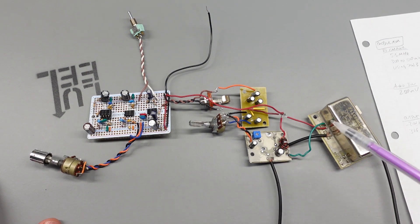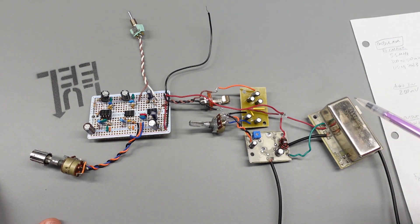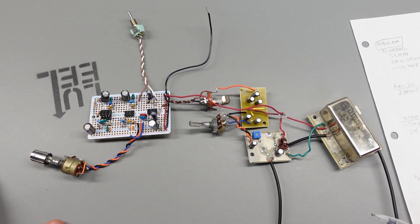A couple quick items before I move on. I want to touch on the trimmer caps — C5 and C7 are both missing. I was going to adjust those to maximize signal throughput through the filter. As it turns out, I dialed them down to minimum and kept getting stronger and stronger signal. I swapped them out for units that go down to 2 picofarads — basically almost zero — and the signal kept getting stronger. So I took them out. As EMRFD mentioned, they may not be necessary depending on which filter you have, and this one didn't need them.